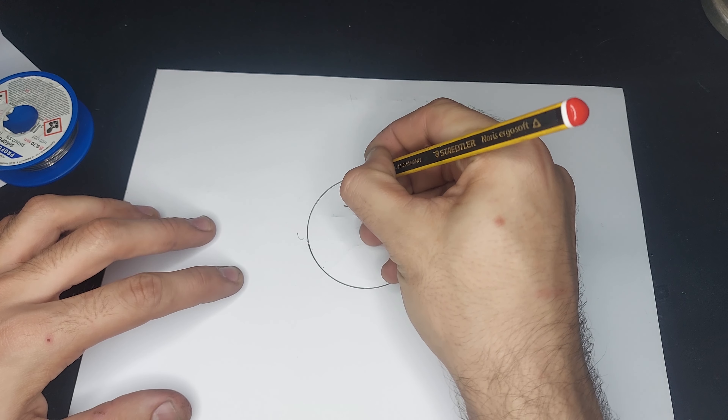It's set to 310 volts, but it's not striking. Let me drop the voltage a bit — and it's gone off. It's around 120 volts, so this is basically a 120 volt Zener diode.